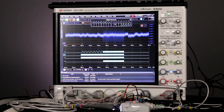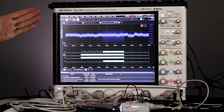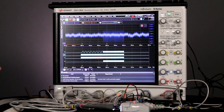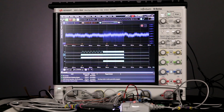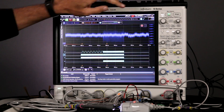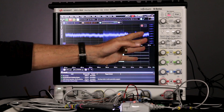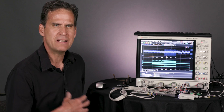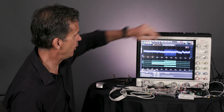What we see on the screen is the power supply — it's about 3.3 volts, looks kind of stable. Then we can see some noise happening around that simultaneous switching. To be honest, I can't really tell if there's something going on after it calms down or maybe not. That's the problem with these probes and why we like to use the specialized tools: the power integrity probe or the power rail probe.